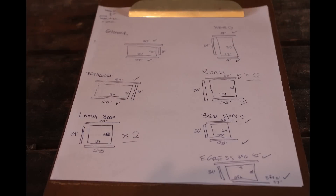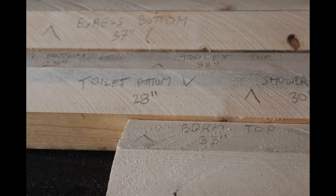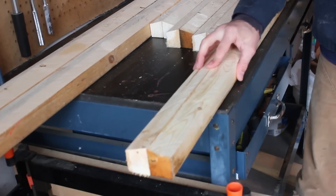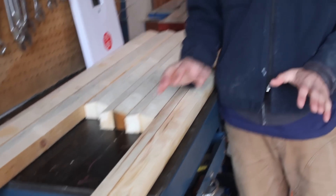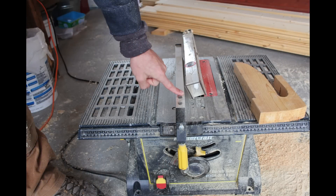Kiva made a chart of all the pieces we're going to need with their lengths and everything, and we've been pre-marking and labeling all of our pieces and then checking them off on the chart to make sure we've got everything. To get the pieces even, we did a couple of test cuts and then adjusted the fence on the table saw until the results were nice and even.